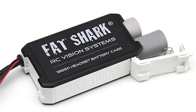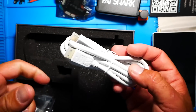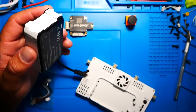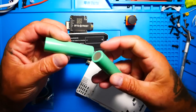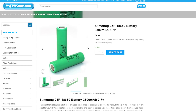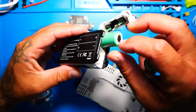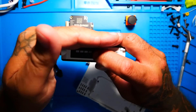The VRX is built to hold two 18650 batteries — not a built-in battery pack. Those batteries are about seven bucks a piece and you can get them from any drone store or vape store. This battery pack case does not allow you to charge in-place, so you'll need a separate charger as well. That part I'm not a fan of — I think there should be a USB charging option.